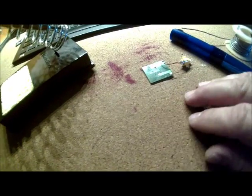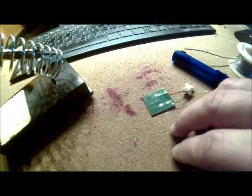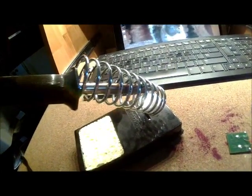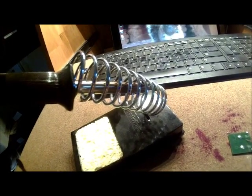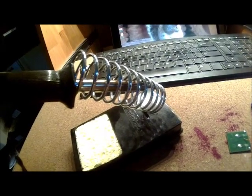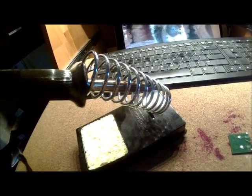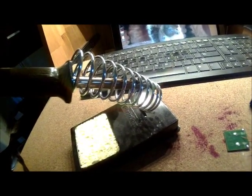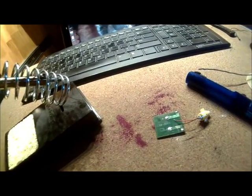Notice I have a cork board here — it's not a great idea to solder directly on it so just be careful. I do have a holder for my solder and iron. Observe the safety factors: work in a well-ventilated area, my windows and doors are open and a fan is running sucking air out so fresh air comes in. Also treat a soldering iron like it's always hot — so many people burn their hands by touching the tip.